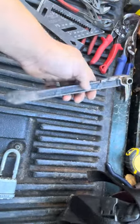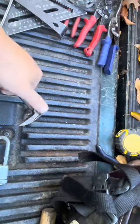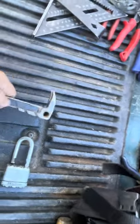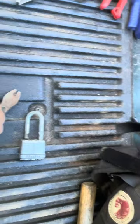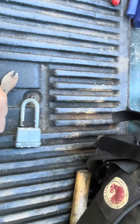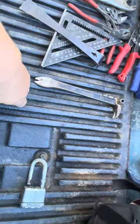This right here was actually my very first catspaw — a little DeWalt. It's pretty light so it doesn't add a lot of weight to your bags, and it doesn't really stick you in the legs very often. What I love about it is when you're working on exposed material, you can put it over the nail head, hit it a couple times, and it leaves a little indent around the nail in the wood. That way when you put the catspaw in to pull the nail out, you're inside that indent and it won't splinter the wood.